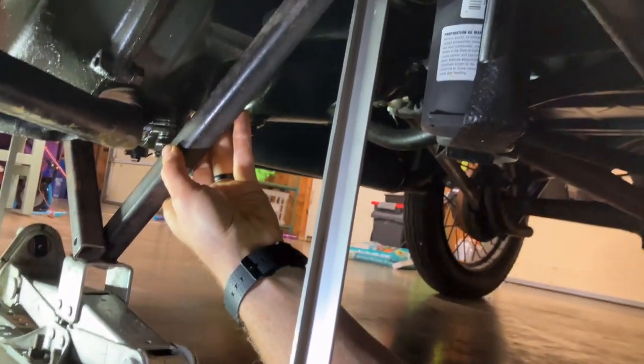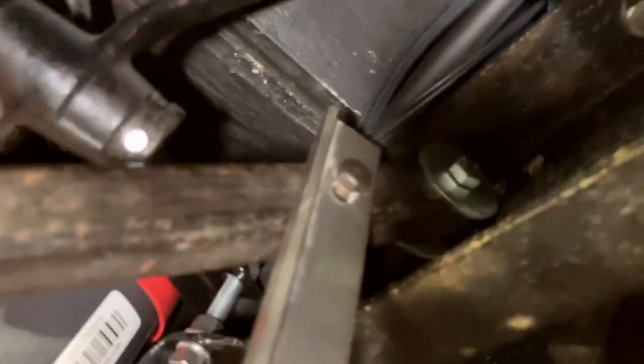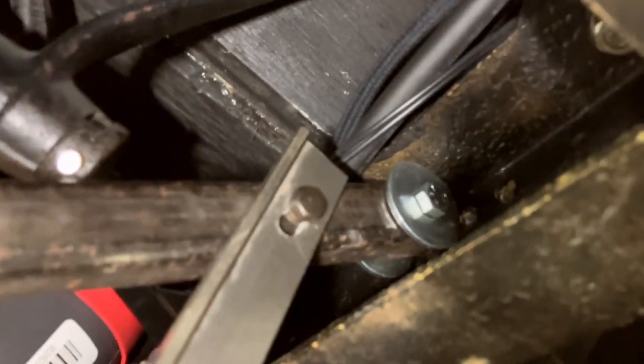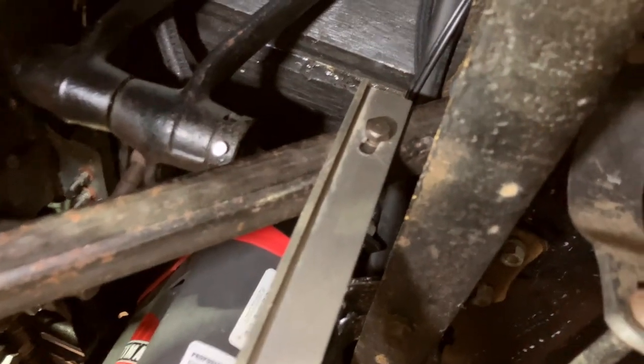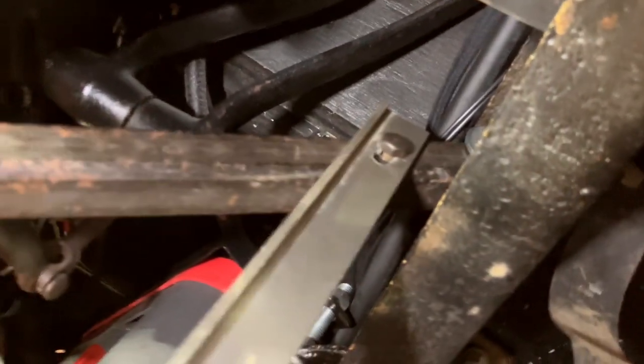So now you're going to take the other hinged arm and you're just going to prop it, get it right up in here, so you can see how these casters are just socking right up against the top of that channel in the chassis. And this one has floater motor mounts, but that's where your rear motor mounts are going to be. So right now you're looking toward the back of the car, right? There's your battery. So these are just behind the rear motor mounts. So you're gonna sock that up in there.